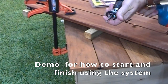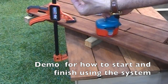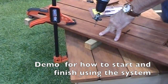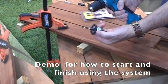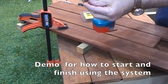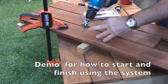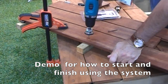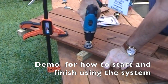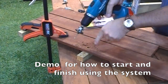With a cordless drill, I'm simply going to engage that. It has an exact set depth to marry to the plug, and the pilot hole will go all the way through. The preparation of the hole is what we call a counter bore tool. The counter bore tool fits into your cordless or electric drill — it sets the exact depth to suit the plug and also the exact diameter. All I do is set the distance to come in. What you will notice is the ring on the top stops spinning once you hit the depth.